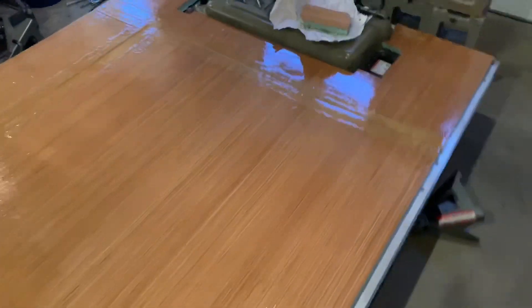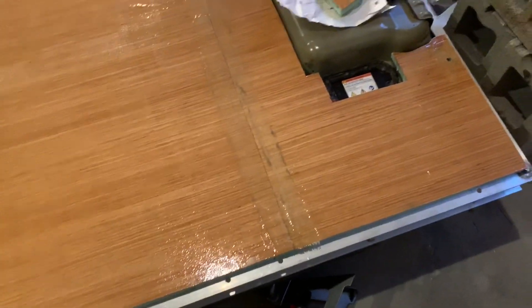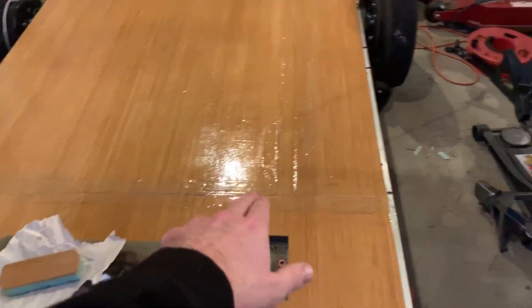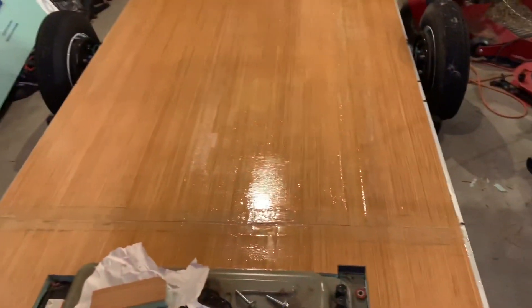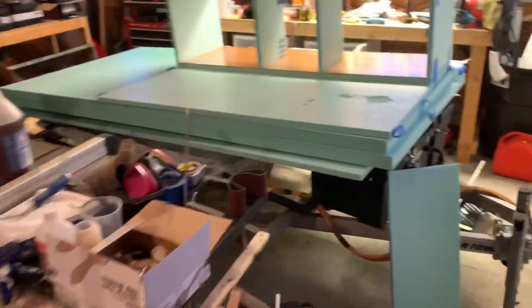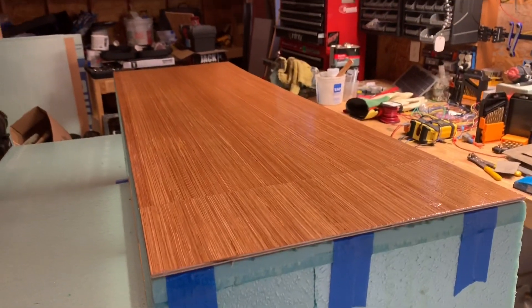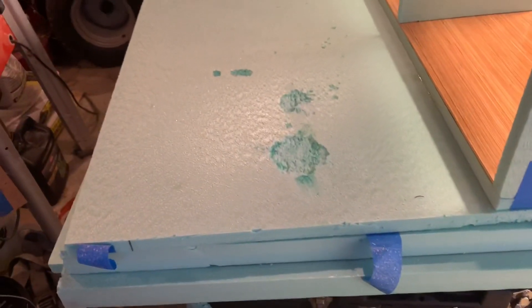I'm doing the second layer and I think it all came out really pretty good. I'm pretty happy with it so far, and these marks are starting to disappear. This part anyway is going to be mostly covered by the box over there. I really filled in the joints — put a lot of epoxy on them to fill it all out. I have a six-inch drywall plastic spatula thing, so I took that all the way down both lines and smoothed it all out so it should be pretty flat. I've got the heater going, I just did the top of this one nice. I've got a six-inch foam roller that worked great. Also — had no idea — but acetone melts foam, so keep that in mind if you're going to do any of this.